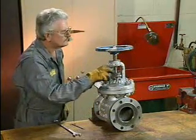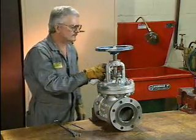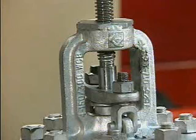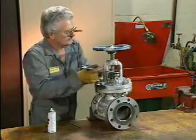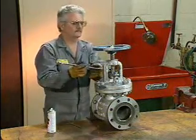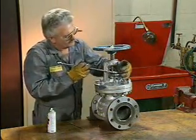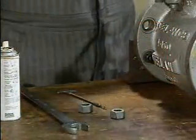The mechanic sprays a penetrating lubricant on the bolts to make the gland nuts easier to remove. If the nuts are rusty and won't move, the lubricant should be given a few minutes to work. Using excessive force may twist or break the bolts. Now the mechanic turns the gland nuts counterclockwise to loosen and remove them. He stores all the parts together in a safe place.